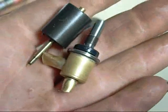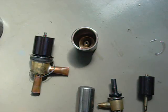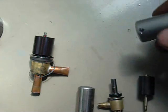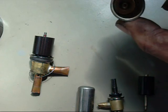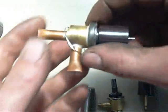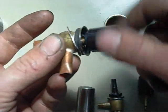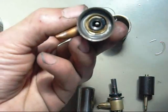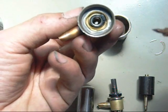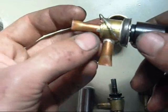Thanks for watching folks. One last thing for comparison — I've opened up the Mitsubishi valve. You can see there's a centre bearing in there, a little bronze bush, and it works off the same principle: it will unwind so many turns or wind in so many turns. Needle and seat, and you can see down the centre there where the liquid is let out. That's the expansion point for these units.